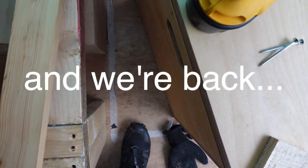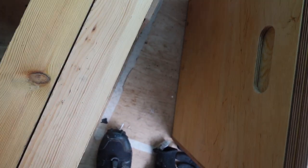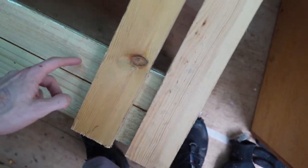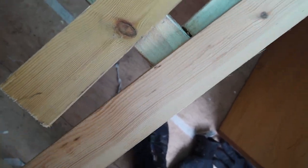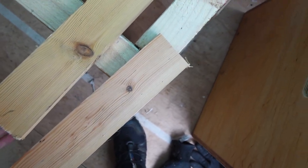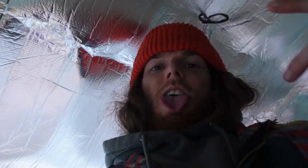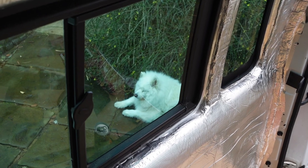But this is what has to happen. The idea here is, one slot here attached to the outer frame, one slot here, maybe a little space, and then one slot attached to the inner frame. So when you pull this, the outer frame one comes out like that. Inner frame one stays in. They alternate all the way down, bam, bam, bam, bang. You got a slide out bed.